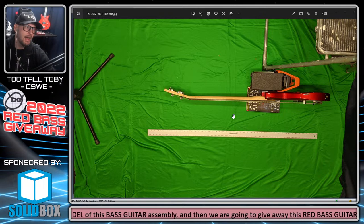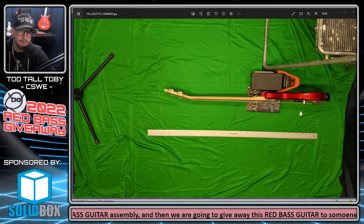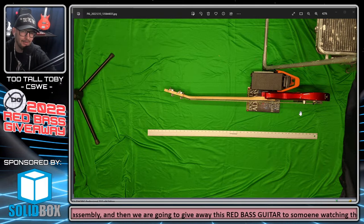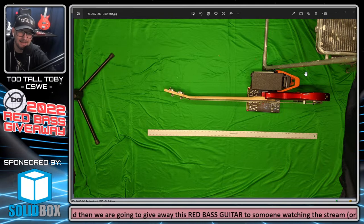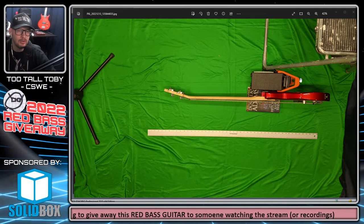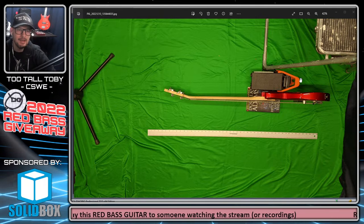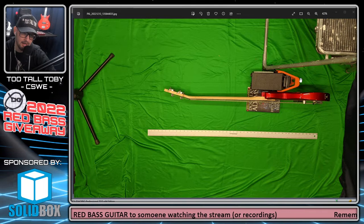So that's absolutely a wonderful question, and that's something you need to think about. If you're going to use this approach, you're not going to be plus or minus one thou of an inch. Your tolerance is going to need to be a lot higher. So it really depends what you're trying to accomplish. If your goal is to create some 3D printed parts that you're going to retrofit to this base, then using the photograph approach is probably good enough.